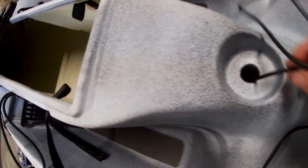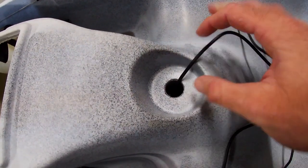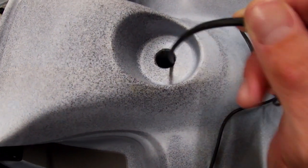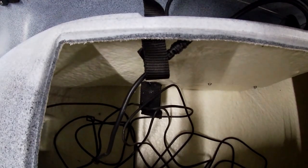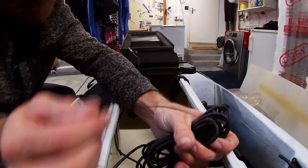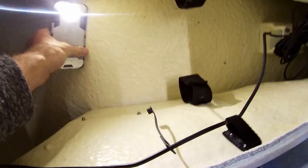Once your cable is through, there's still the hole — what I do is push a little bit of the cable in there, just like that, not too much. You can feel it's pushing back out. Put the foam in there but if something pulls it, it's got that give, so it doesn't put a lot of pressure on the transducer. Push the cable through that piece and over here. Now we plug up the hole. These little clips here — for your fish bag basically — you run your cable through that and keep tracking it through. Get yourself a cable tie, cable tie it closed.